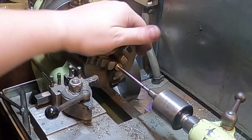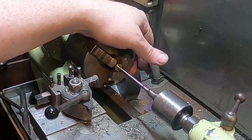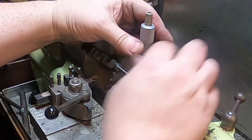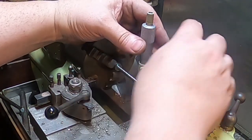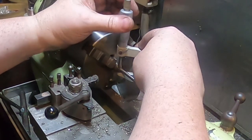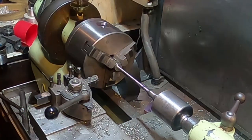So the only piece of stainless I had in the place was 12mm. So I've machined this down to what, a 5mm, which is what I reamed the pump housing for. It's right to there because I couldn't get this cutter right in against the... Yeah, so this little bit's a little bit bigger on the end, so I've marked that. And we're about 0.01 over there. So I might just give it another bit more of a rub.